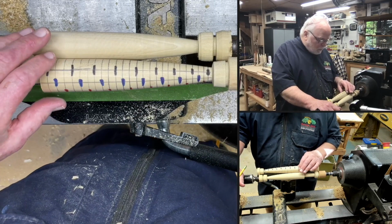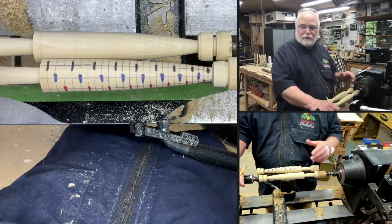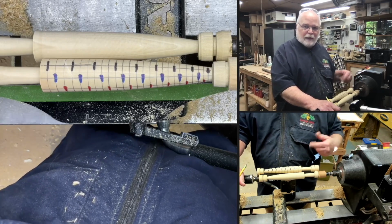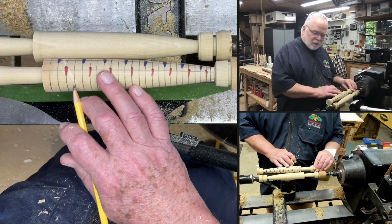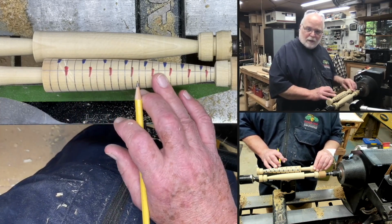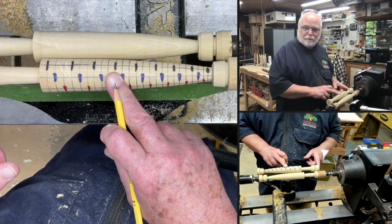You may be wondering why we do this 3 times. It's because we've got 3 axes. If we went to a multi-axis of 4, where we were doing every 90 degrees, we'd add another series of branches in here and go to a 4th grouping. So it always corresponds to the number of axes that you're working on.